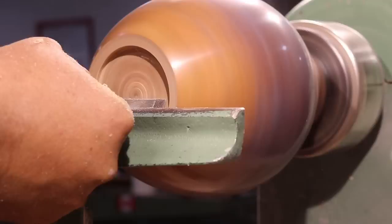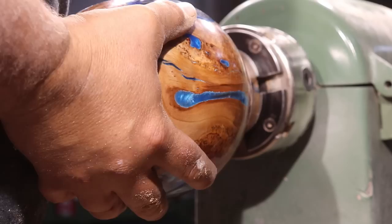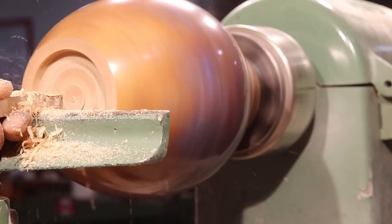I slowed this down 50 times to try and figure out what happened here. You can see the chisel is just barely touching the wood — there's just the tiniest little fine chip coming off, and then poof, it's gone. But if you look in the jaws, you'll see there's blue resin left in there. I never had that happen before. What I suspect is that I probably had some cactus juice resin left on the top of this because I really didn't go back over that part — casting resin doesn't bond well to cactus juice resin, so my guess is that that bond just broke.